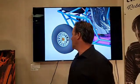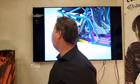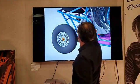And remember, Arctic Cat never built a 77-inch wide car. They only built a 64 car. So for sure, we are way different than what the production base car is with Arctic Cat or Textron. A few things we did is we moved the sway bar for more clearance. The reason for that clearance is it gave us more engine clearance compared to where the sway bar was mounted before. It also gave us room to get an alternator belt up into this area up here in a protected area behind the seat, which should be better for mud, should be better for dust and terrain.